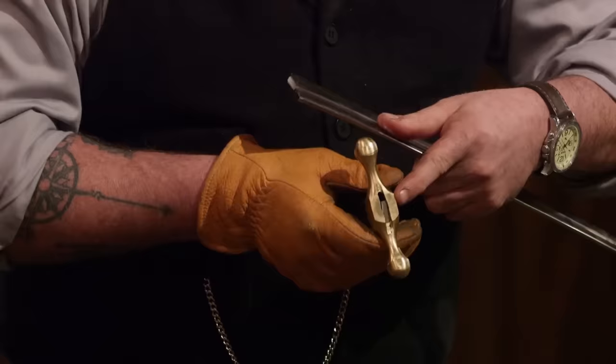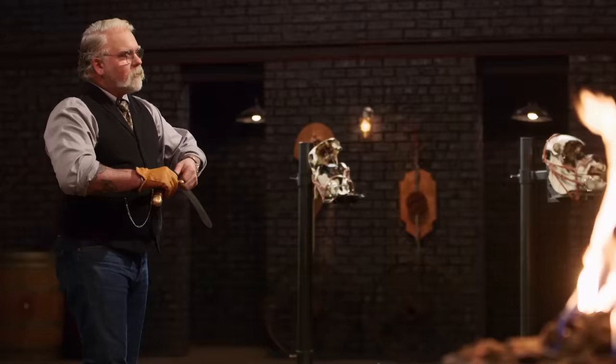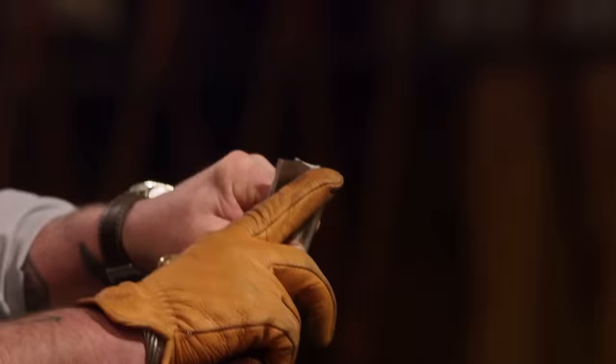Okay, so before we get to the obvious, I really like the design of your blade. It's got a great weight to it, had a really good feel in my hand. The balance was really nice. See all that space around your tang? With that room for that blade to move inside the guard, it could just create so much stress that it cut loose right there at the corner. If it were all tight, there wouldn't be any stress. There's no discoloration here, so it's not that there was a crack here before. Your grain structure looks fine. It was a well-designed piece, but obvious flaw.